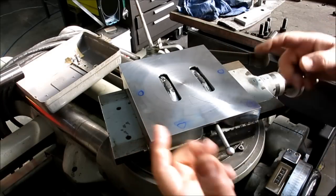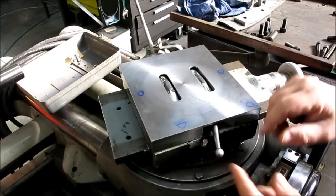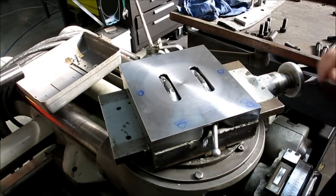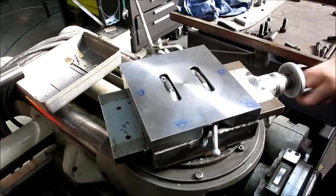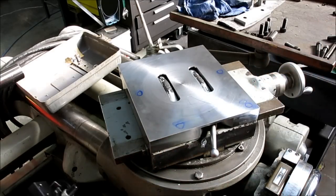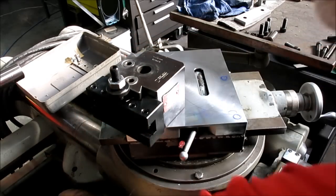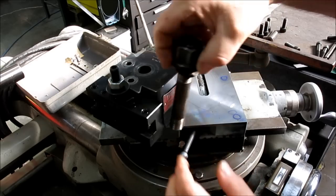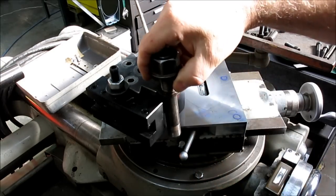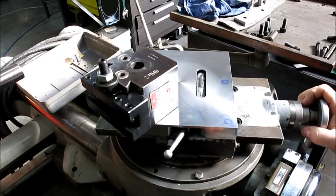The automatic bites me again. Here's this guy here - you can see that little pocket that we made for that little lever there. So we're going to add some mounting holes, and then we'll add the tool post stud threaded hole in a couple of places. Once we get it mounted, we'll sort out where we want that.